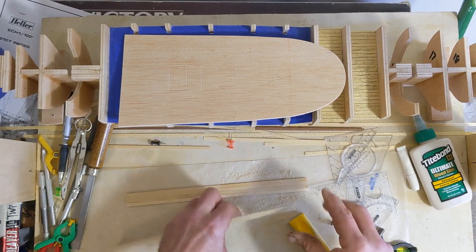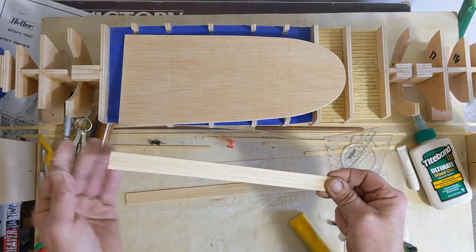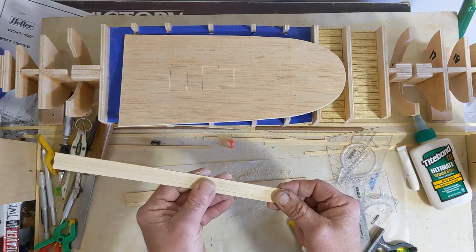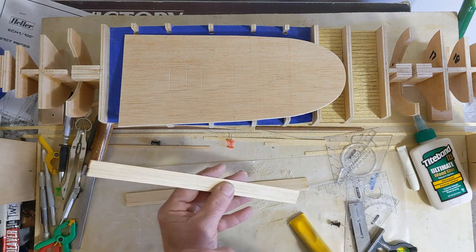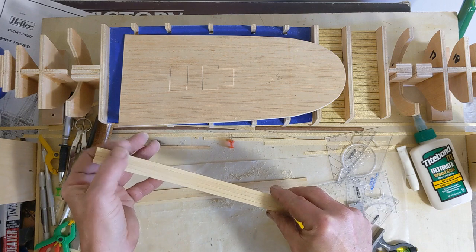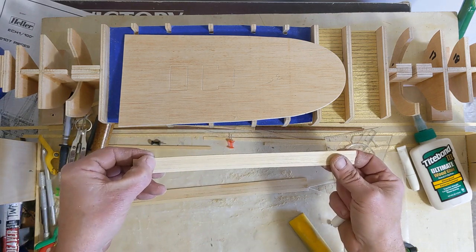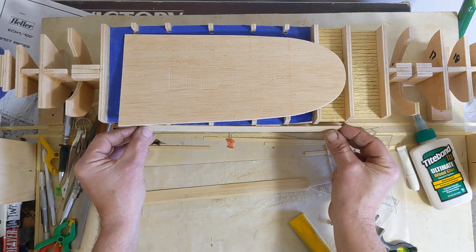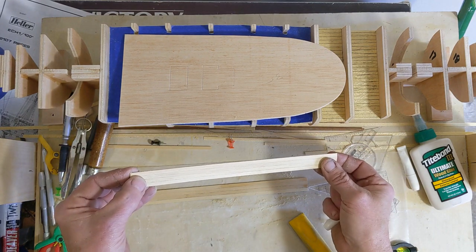Then I gotta think about what I'm gonna do here about the nailing of these. It's a pretty confined space in there, obviously. I'm gonna mark them with the pencil before I stain them. Then I'll pre-drill my holes. Probably only gonna be able to get one nail in each plank on these. I might get two. Really should try to get two. It's more realistic with two.